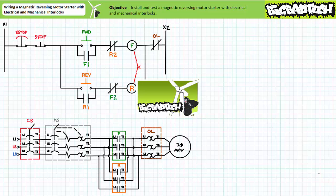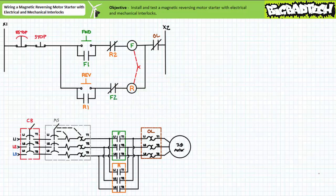If you haven't watched this lecture yet or only dimly recall its contents, please take the time to do so now. This exercise also operates under the presumption you have watched the preceding lectures detailing the progressive construction of the motor control trainer board. An extremely common magnetic reversing motor starter, as implemented in the above-referenced lecture, makes use of paired contactors.